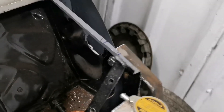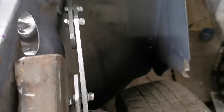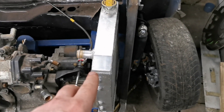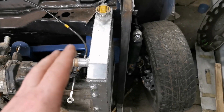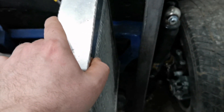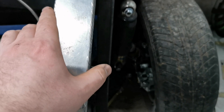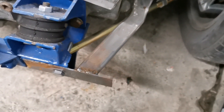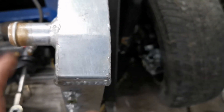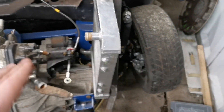And then there's this side. Again, bolts through the top there like the other one. You can see — come around there. That looks like it's touching but it's actually not. I might get some smaller ones just to make sure. It comes down, and this is roughly where the radiator is going to sit. So I wanted this for two reasons: one, I'm going to use it to mount the radiator off; but two, I wanted it to avoid the radiator. Plus I want to fit a fan, so hopefully it might sit a bit further in. We'll probably work that out next episode.